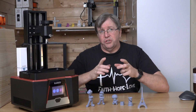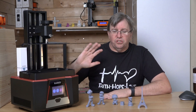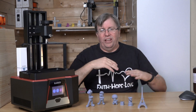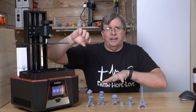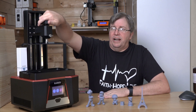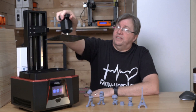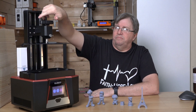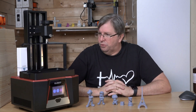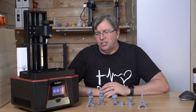This machine has about double the screen size of the LD-002R that I previously reviewed. Bed leveling is super simple - you've got two huge screws which you loosen, put a piece of paper or leveling card underneath, press it down tight, and tighten those two screws for a nice level bed. There's a huge nut on the top which is really useful for removing the build plate - it keeps your hand away from the resin. Print adhesion to the base is good but does take a little prying to get prints off.